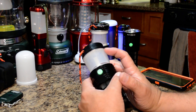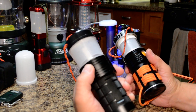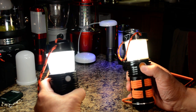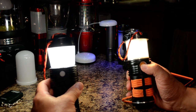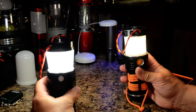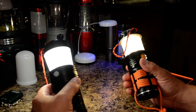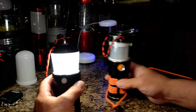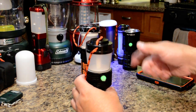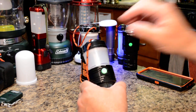Hopefully we can go with the Samsung LH351D series LEDs — I really like the tint. I tested the 4000K and 3000K versions. The 4K is a little brighter, but I like the tint of both. The CRI is very nice with not much tint shift, very similar to a Nichia 219C but with more efficiency at lower amps. I'd prefer these over the XPL series or the 219 series for lantern use. With tint ramping, you can adjust from 5000K down to 3000K or maybe 2700K depending on the LEDs selected in the final build.